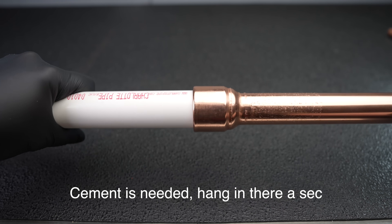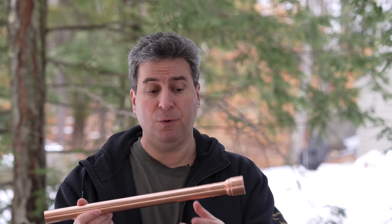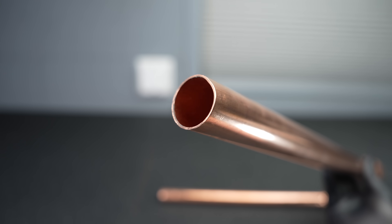These come in three different sizes: this one is one inch, and they've also got three quarter and half inch. The reason this pipe is so long is they don't really know what you're going to be connecting to, and this length also allows plenty of distance if you're going to be soldering the end so that the heat won't conduct too far over and melt this fitting.